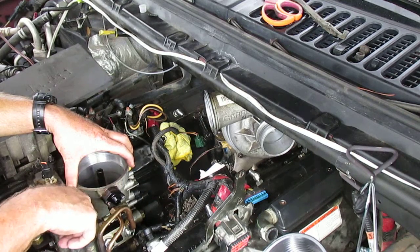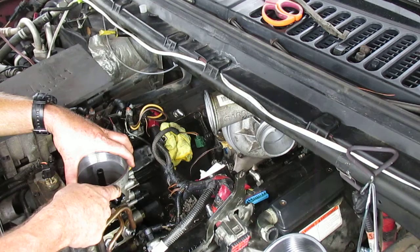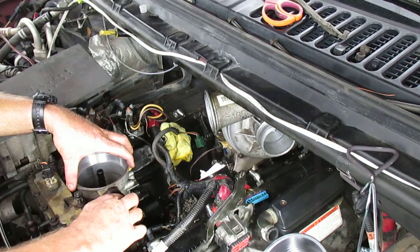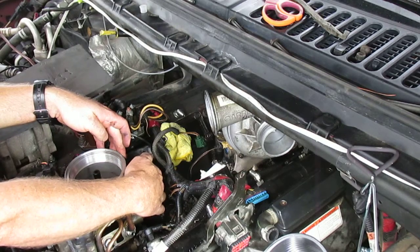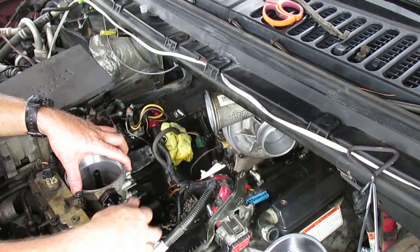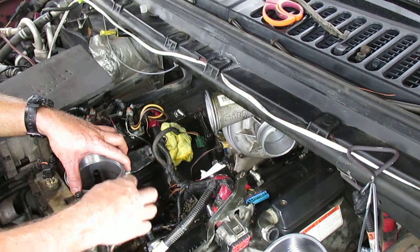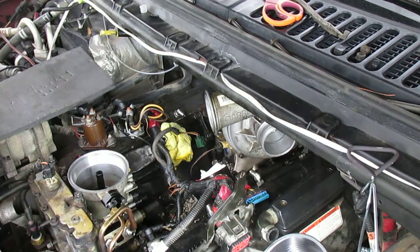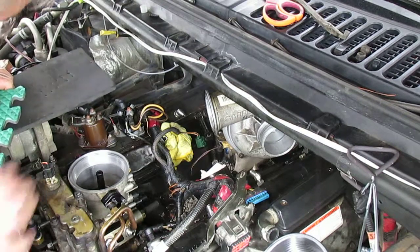Now we did get the updated diesel O-ring.com regulator, and I have the middle spring in there, the 65-pound spring, and I'd actually done this fuel bowl rebuild before. My drain was leaking actually, so I redid that. So that gets the new rubber fittings for these old hoses here. So you got the fuel coming in and then the fuel going back out. So I replaced this with the newer thing, which is something good to do. A lot of these vehicles, they like the higher PSI.